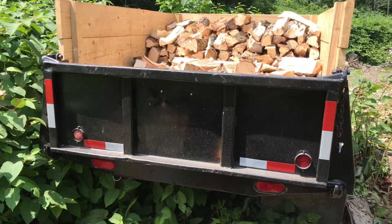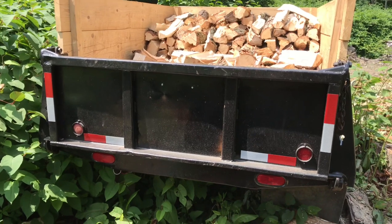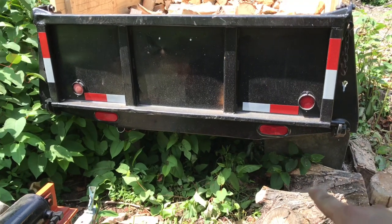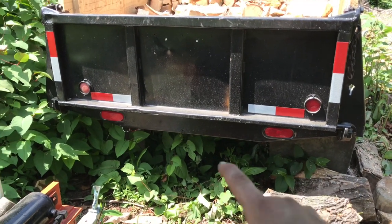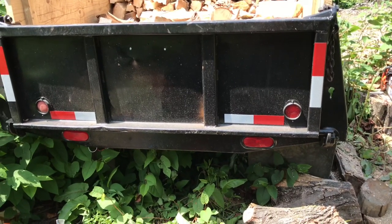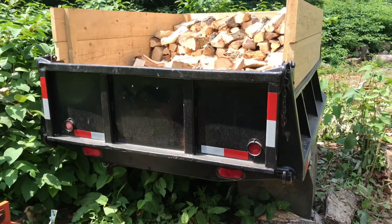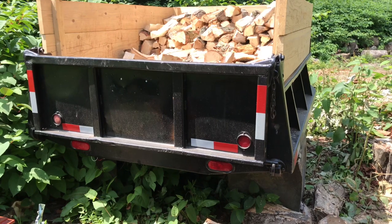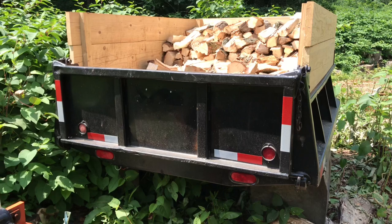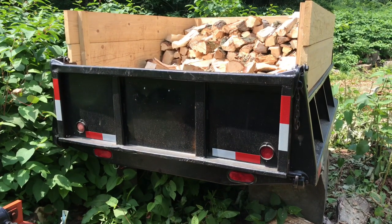This isn't a normal New York State inspection sticker like you get on your car. This is an inspection where they go over everything with a fine-tooth comb — they measure your lights, make sure they're at proper placement off the ground, verify you have the right number of lights, check that your axles and frame are proper size, that you used a proper coupler, that all your welding techniques were proper, that it's completely roadworthy and not stolen.